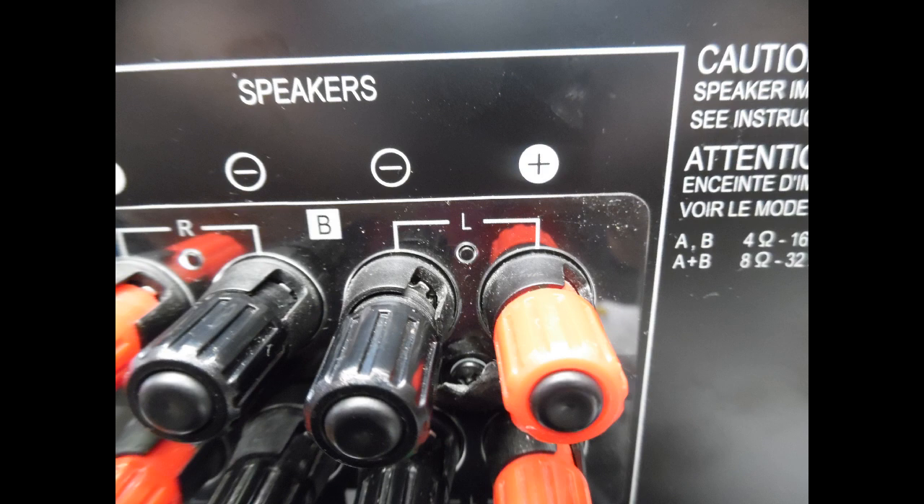Under no circumstances power up the amplifier without the back plate fitted and those screws in place, because it's a common ground point that connects other parts of the circuit - if you do, it will destroy the output transistors. I make sure the grounding screws are fitted along with the screws to the main chassis so there's a common grounding point. This is really important - service manuals don't mention it, as they assume a trained engineer already knows the back panel must be fitted before testing.